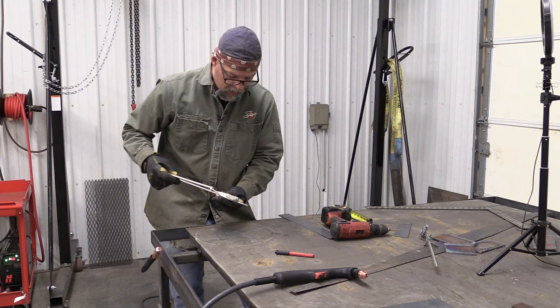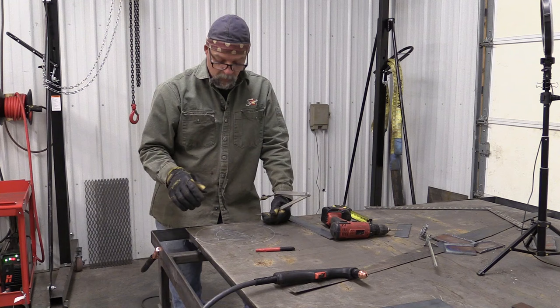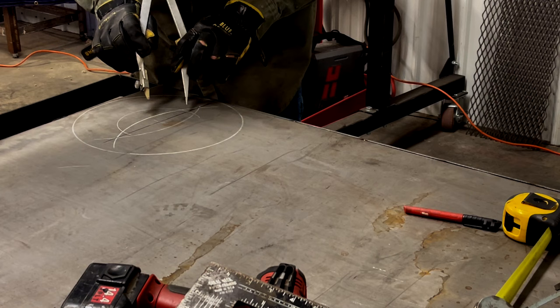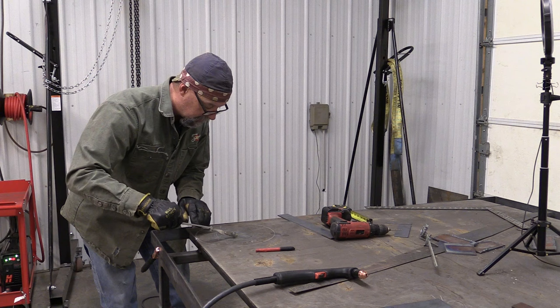And we're gonna go back to our center point again, and make a mark that goes like this. It's basically gonna go all the way from our baseline up to the center here. So now we have a coordinate, a place that we can swing yet another arc from, okay? Stay with me, I know this is a lot. So we wanna go back and go bigger than whatever our center is there. I didn't measure this, so I'm just gonna lay my compass down right here and see that I'm on that spot that I just swung and I'm bigger than the distance to center.